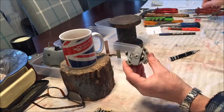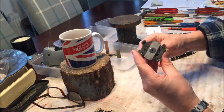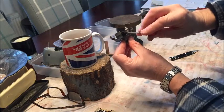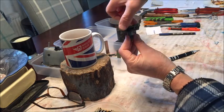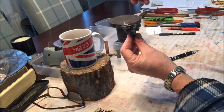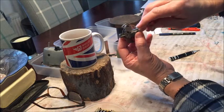Now you can see with more clarity the magnet — see how it spins around. There are also these two rivets, which are part of the assembly that keeps the drive shaft in. One of the reasons I've had to take it apart is because this rivet is loose and it's causing the whole thing to rise. So I've got to re-engage the rivet by pressing down here and putting something in there to splay the rivet again.